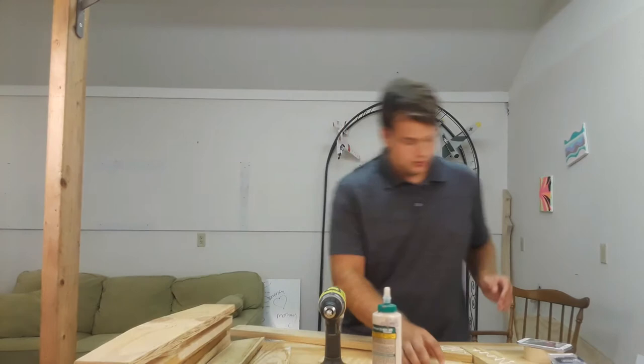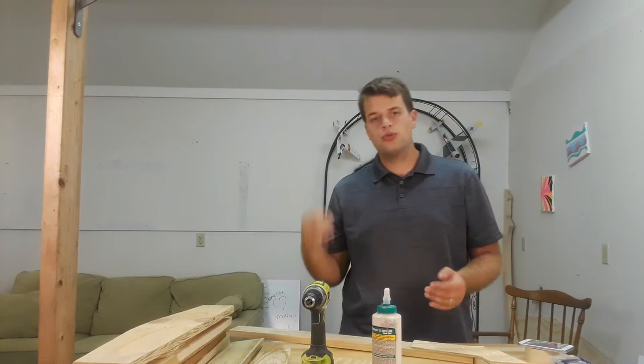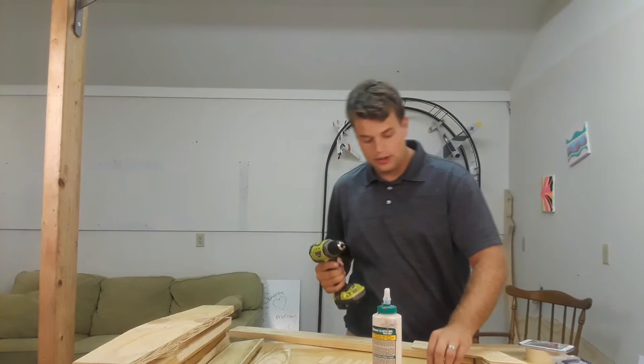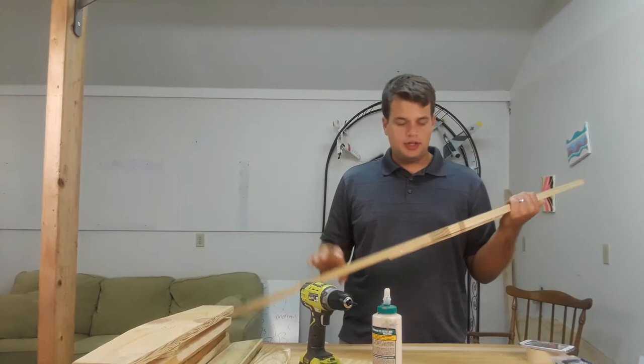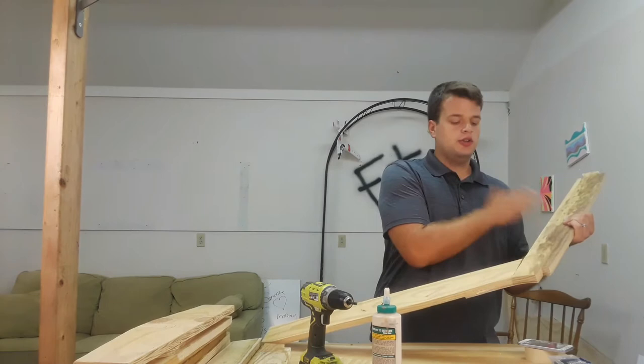I'm using the three-quarter screw. The reason I use three-quarters on this instead of the one-inch is that the three-quarters is more than thick enough to go through the pilot hole, but it doesn't go through the back side of the frame, which means I don't have all these screw tips poking out on the other side. Once I have everything assembled and I've flipped the hull, I'll go back and where any of these cracks are, I'll fill it with epoxy and wood flour, and then go back over top of it with another piece of wood just to seal all of it in.